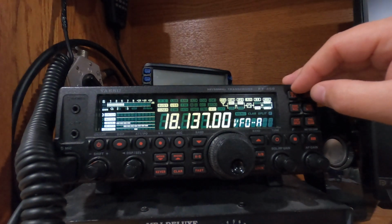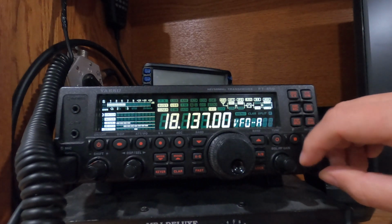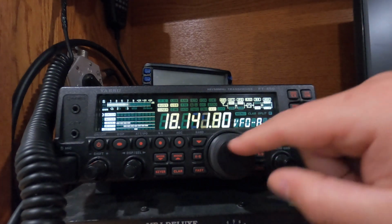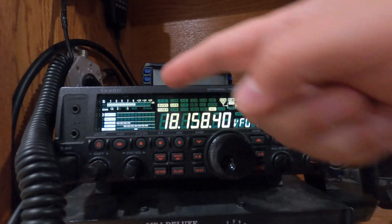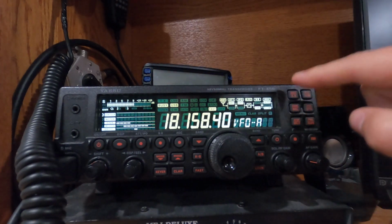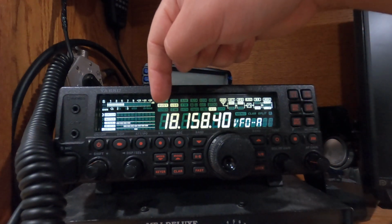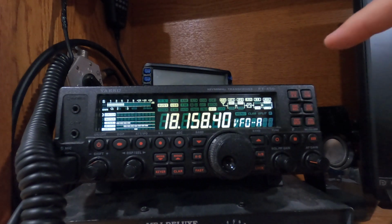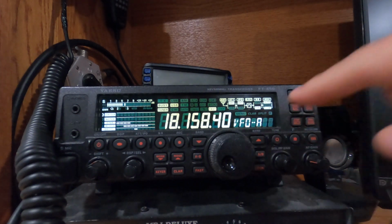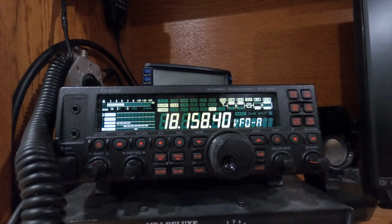So right now I'm on a different band. I'm on what, 17 meters? So this band actually is tuning really well already. Now see the difference. This is with the tuner off. I've turned it off. If I push my keyer button here, we got about 2.5. If I turn my tuner back on and the light comes on, I'm down to a 1 now.